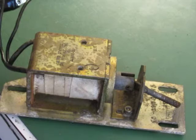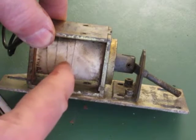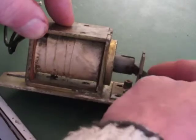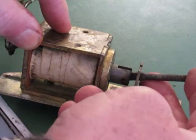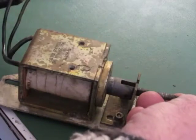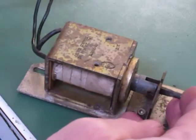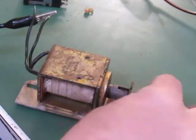So, down here, what it does is activates this little electromagnetic field, which is, this is a coil of wire, and when you send a current through the coil of wire, it creates an electromagnetic field, and it pulls this little piston. And usually there will be a spring connected to this, generally, holding it out. So I'm going to be holding it out, and when I touch this wire to it, it'll pull it in. So right now it's just empty of electricity. Let me spin this out a little bit. All right, so I'm going to hold this here and go...